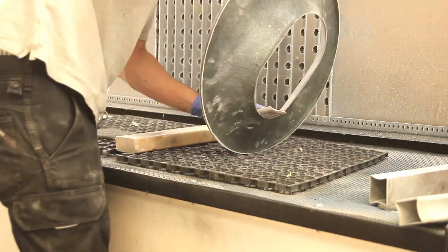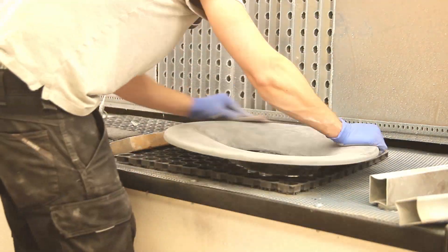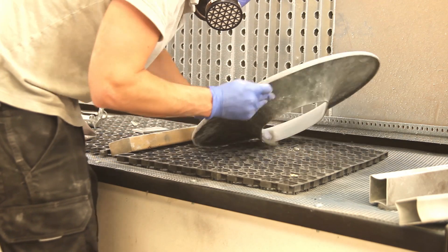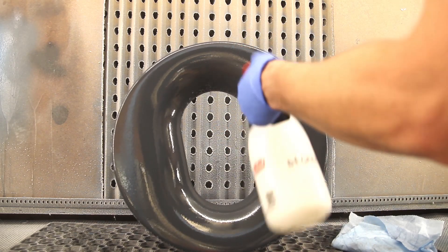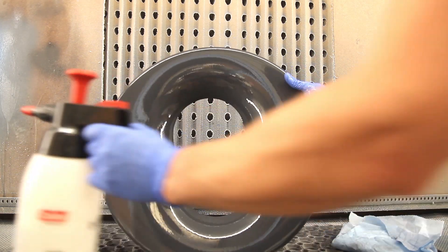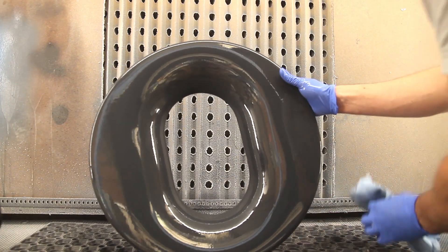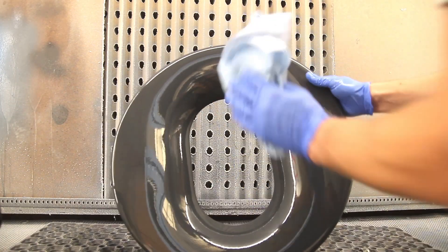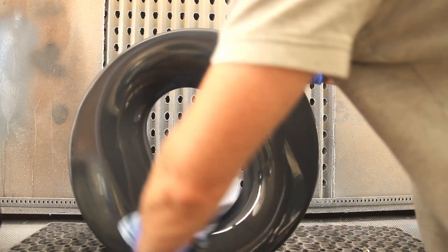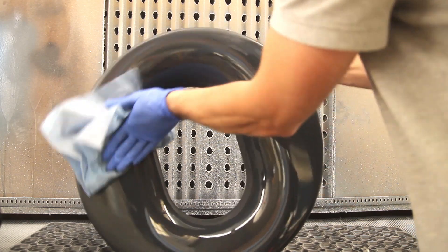While sanding, it's very important to use a sanding block to make sure you're not creating small dents by sanding with just your hands. I'm also applying a degreaser for two reasons: to check whether the surfaces are nicely sanded and the curves are right, and to ensure everything is clean before sending the parts to the spray painter.